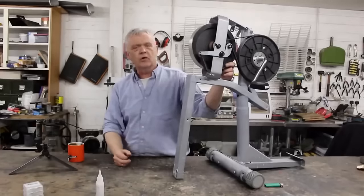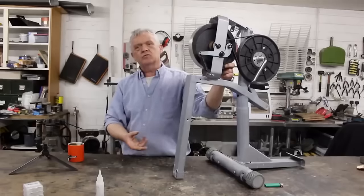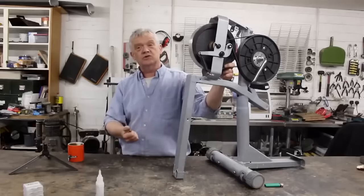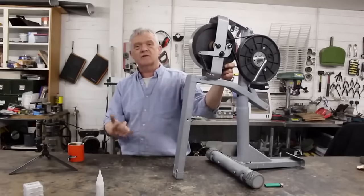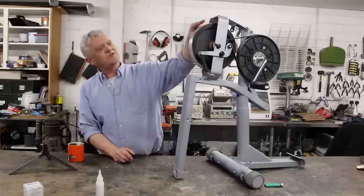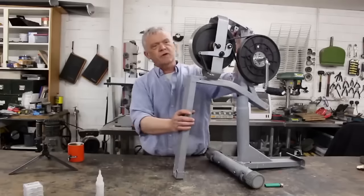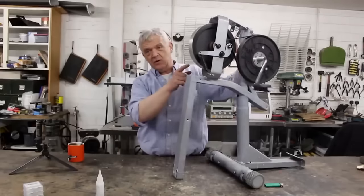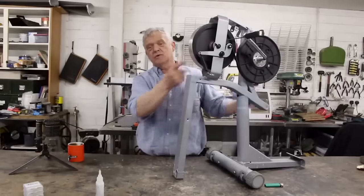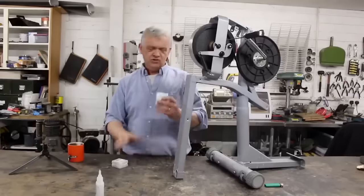Generation is just about having a magnetic field moving surrounded by coils. The generation will depend on the speed at which it moves, the strength of the magnetic field, and the number of turns of wire in the coil. We can turn this flywheel into a generator by sticking a load of magnets on the outside. Because this turns quite quickly even for a slow hand speed, we get a quick speed at the flywheel.